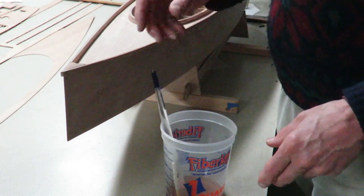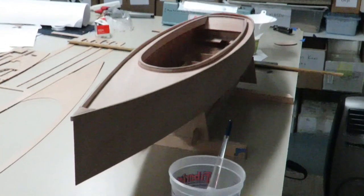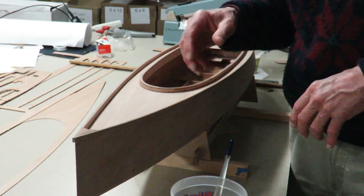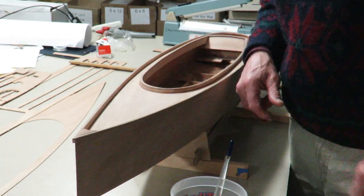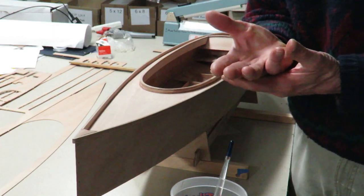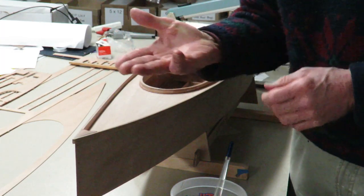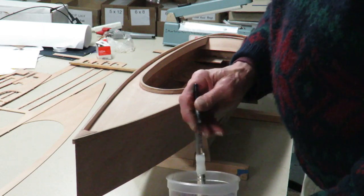And if you have the boat upside down, the deck's going to turn out really beautiful because the dust won't get on the deck unless there's a lot of commotion in the room or a lot of moving air blowing under the boat. So it's a trick to set something upside down. You might think a horizontal surface is a better surface, but varnish won't sag if it's directly upside down on an upside down surface. If you put on too much, you'll get some sags, but it's almost the same as a horizontal surface face up, as far as sagging. So you have the advantage of not getting dust.